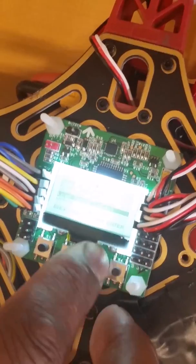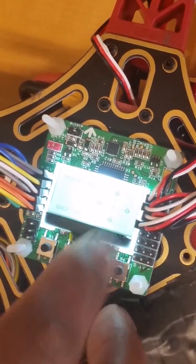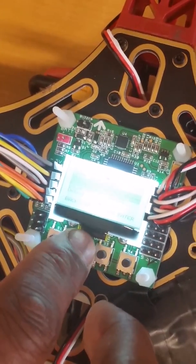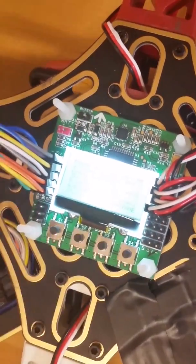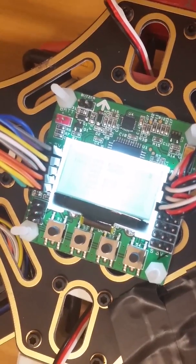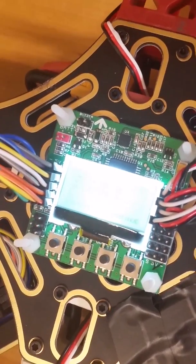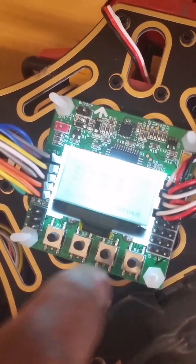Next up, we have the show motor layout, which is just a duplicate of the previous screen, showing you where everything's set up, the location for all the different motors. And then we have the calibration for the accelerometer. Laying this on a flat surface, click continue, and it's going to calibrate everything to sense where that ideal level location is. Once your settings have been calibrated, it's going to give you the X, Y, and Z location for where the quadcopter is going to try to self-level.